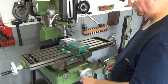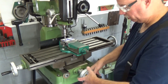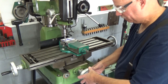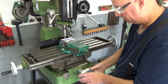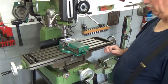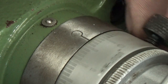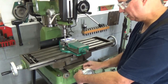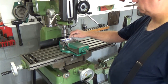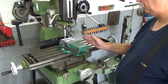Counting off 1 inch 346 thousandths: 13 full turns to 1 inch 300 thou, then 46 more — 10, 20, 30, 40, and 6 lines — giving us 1 inch 346 thousandths. Now we're going to move over and do the same for the length. Before that, I set my collar to zero. Once this is set to zero, I'm never going to change it — that is my new reference zero representing the axis through the center of the part. We'll now do the same for the x-axis.